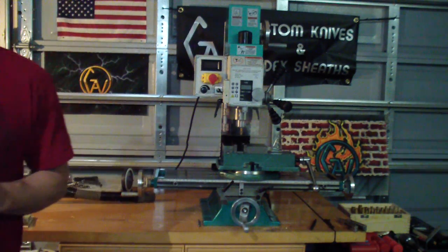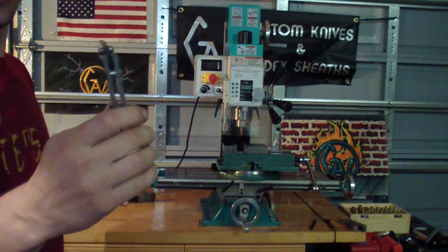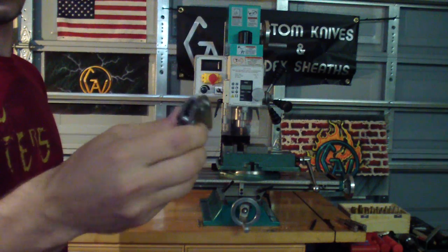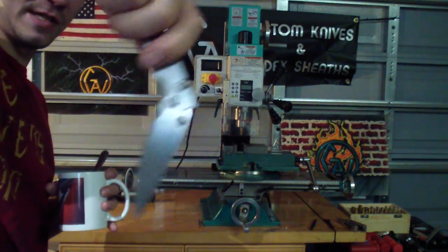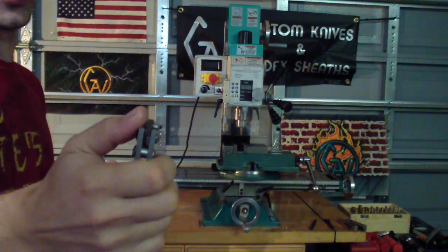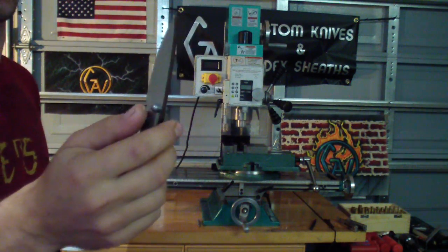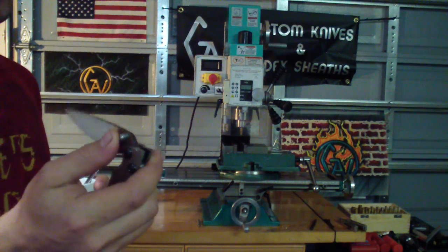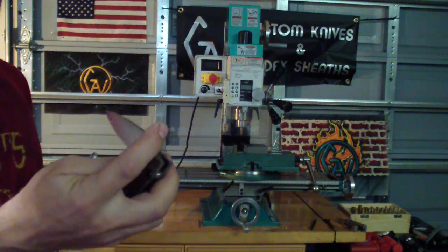I did already actually yesterday when I was playing with it. I did a counterbore on this number 10, the lefty. It already has the bearing pockets and it has the bearings in it. The knife isn't finished yet. I'll probably try to do it today, but it's super smooth now, and this is a sloppy job I did inside. I don't know how to use it, so it's not perfect. Probably if some machinist would look at how it actually looks from the inside, they would say that I'm crazy, but it did the job.